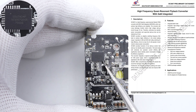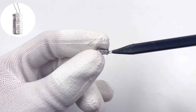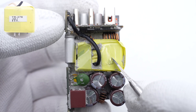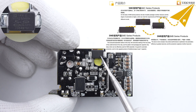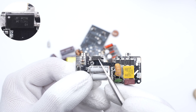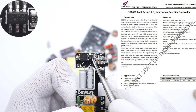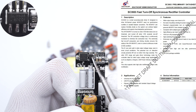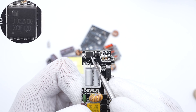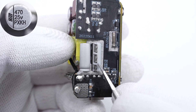The main control chip has been upgraded to a South Chip GaN IC, which integrates multiple working modes and adopts a QFN 6×8 package. The tiny capacitor powering the main control chip is from Yongming, 50V, 10μF. The largest component is the transformer, tightly wound with yellow tape for insulation. The SMD Y capacitor is from TRX. On a small vertical PCB, the SMD optocoupler from UTC is used for output voltage regulation. The synchronous rectification controller is from South Chip, supporting adaptive turn-on detection and fast turn-off, compatible with ultra-low quiescent current MOSFETs. The synchronous rectifier is from Lihou Micro in a DFN 5×6 package, rated 100V. Two solid capacitors from Yongming NPX series, 470μF 25V each, are connected in parallel for output filtering.